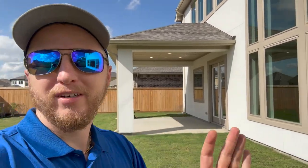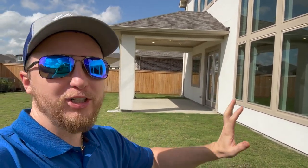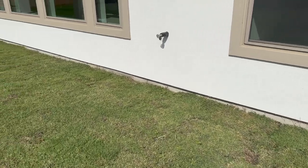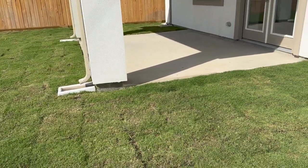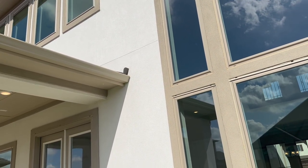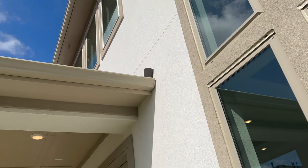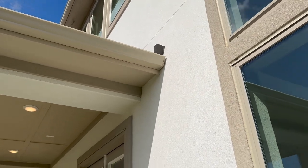We are in the backyard and the structure has stucco. I want to show you everything that is done right — I always tell you everything done wrong about stucco, but this is pretty much a perfect installation. On the exterior you can see proper clearance from the ground all the way around. Even on the pillars — this is where they mess up a lot, doing stucco all the way to the ground — it is properly separated. At the top, where the wall continues and the roofline stops, they have kick-out flashing at a 45-degree angle that protrudes, and there is separation between the gutter and the wall to help prevent water damage on the stucco.